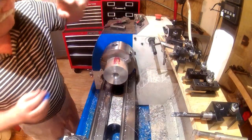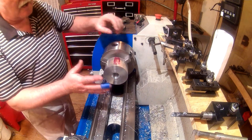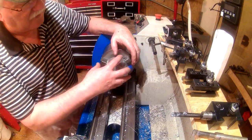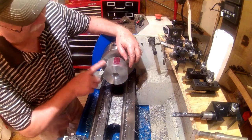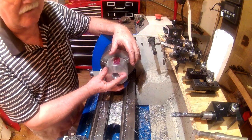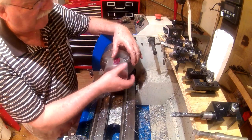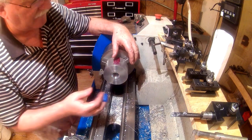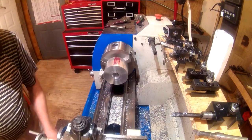It's a good amount. It's going to be stringy, but I'll get set up for that and make a couple passes. After we get this taken out, we're going to go over to the mill and put this in the rotary table with this part down. So I just want to get this right here down to where I want to leave as much stock as I can, just to give it mass while I'm doing all this machining on it. But I want to get it down small enough that it'll fit in the 5-inch chuck that I have on my rotary table. So I'm going to get this back here,